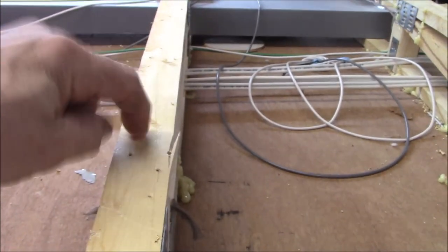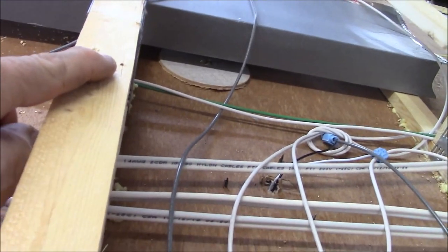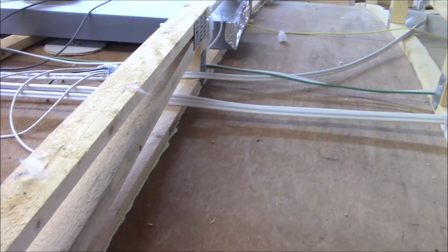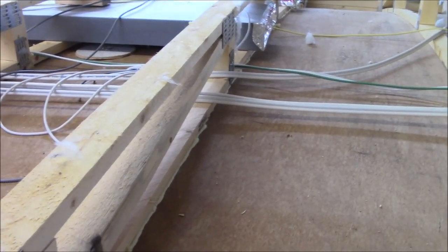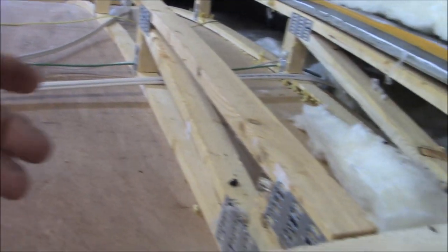They screwed it down. I don't recommend screwing into this type of truss, because, you can see, that's not terrible, but if you put enough in there, you'll start to split the wood. This one just got the edge, but it's not all split up. If you had put more screws in, it could have split. So they say don't put a lot of screws in it because it'll split. Okay, well, here's an idea. If you staple it down, the staple is going to hold incredibly strong, especially if you glue it. So you're not going to have any issue of splitting them either.